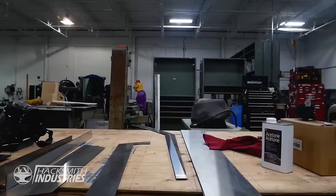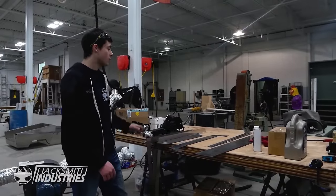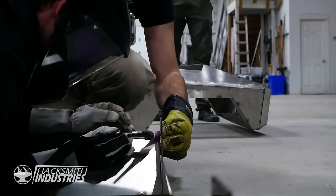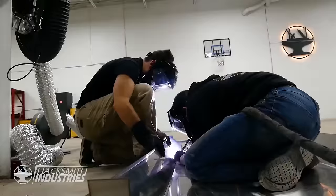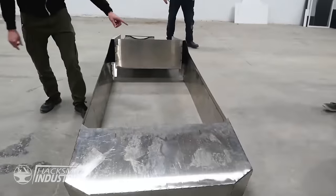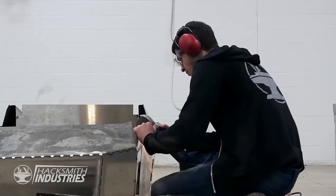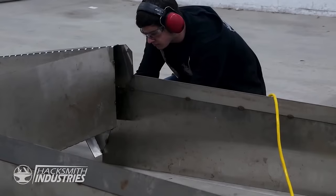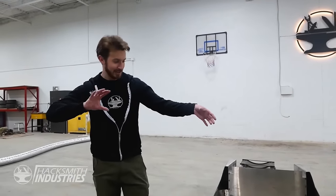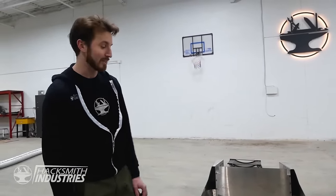So we got the final pieces of the Cybertruck cut. We're gonna make the base plate and the roof of it, and then we'll be ready to mount the motors. When we welded it, the frame is slightly twisted, and we think it's just this one side piece. So we're going to cut the welds, let it sit flush again, and then hopefully re-weld it without the twist. If we leave this and we start welding more stuff, we're gonna keep adding up the stresses, and the whole thing might twist even more, which we definitely don't want.